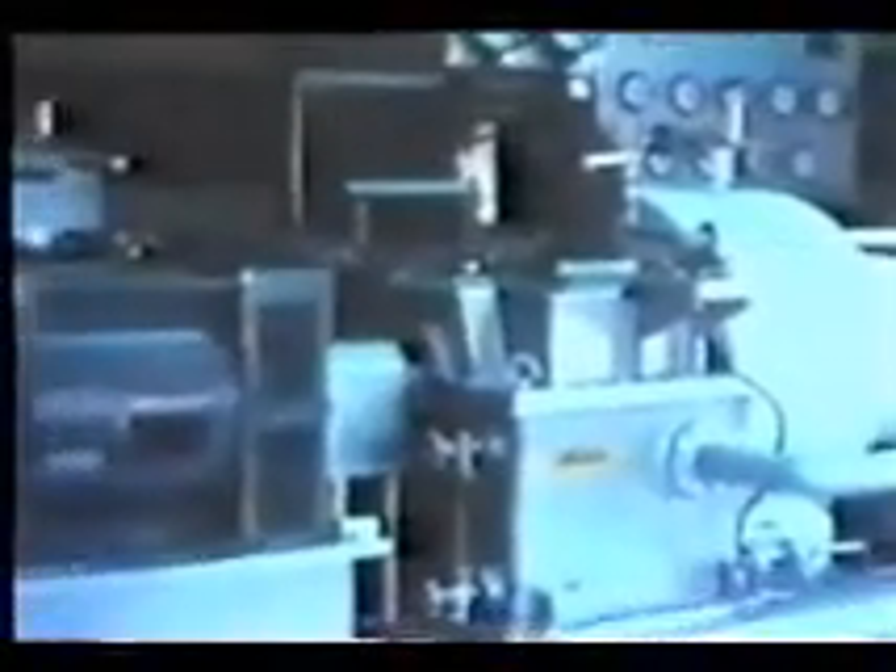The generator is an air-cooled three-phase synchronous one directly connected to the turbine. The shaft sealing system is a very important turbine component. The plant used the wet-type mechanical seal which had a high sealing performance whether the turbine was in operation or off.